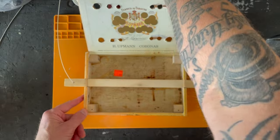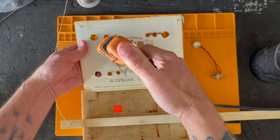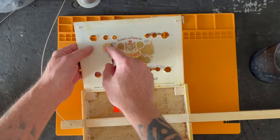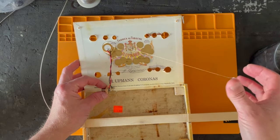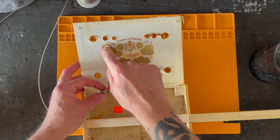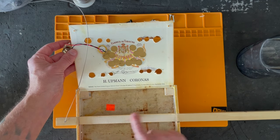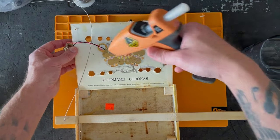So when you open it, the piezo will be out here on the correct side. Let me go ahead and put a little bit of hot glue there — make sure our glue's full. All right, don't let it dry — just get it right in there. Keep in mind that is going to be hot, so be careful. Push the piezo into the hot glue and get it down fairly close to the actual lid, as close as you can to the lid. And be careful not to get too sloppy with your glue because it does have to still close and clear everything.